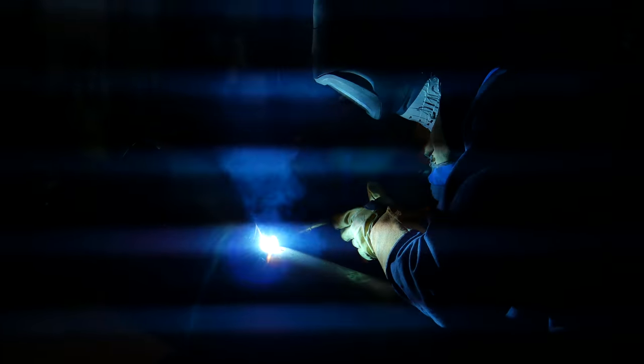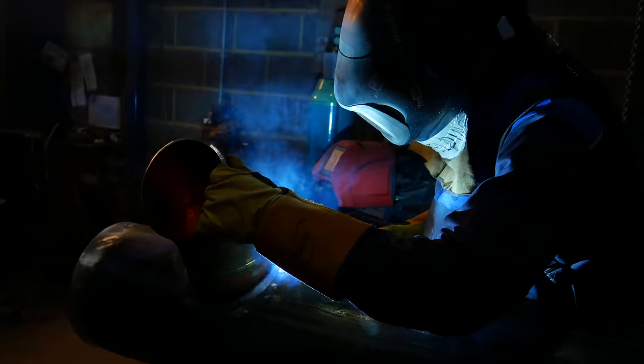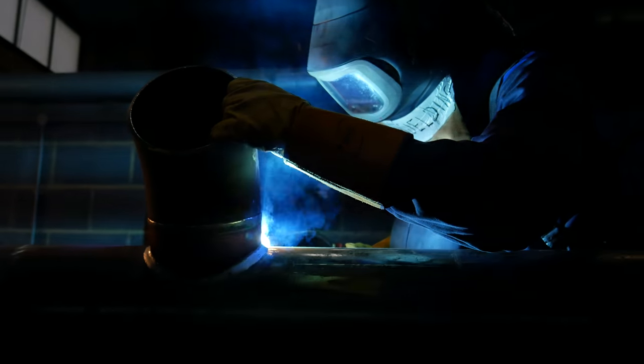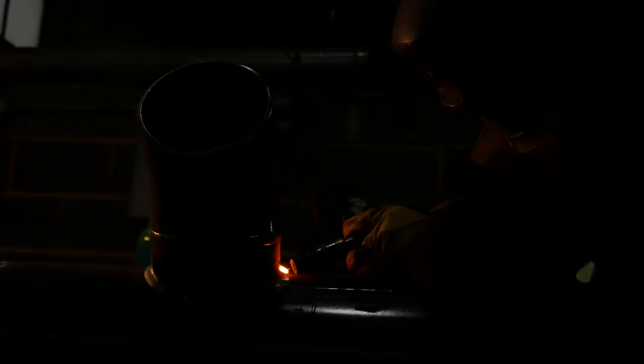It's getting a bit hot right here. I'm doing a bit of back and forth until I can feel it's getting hot — it's burning my hands as well. Now I'm coming to my start stop. I'm turning the pipe up. I'm going to come over it in a second. Now I've started and I'm going to go over about 20 to 25mm over my start stop, just so it blends in nicely. There we go — that was more like 30mm. So there's the first run.